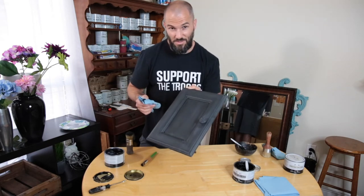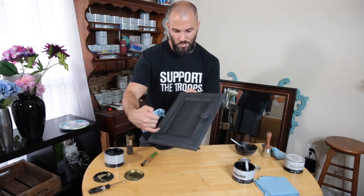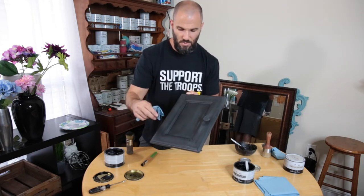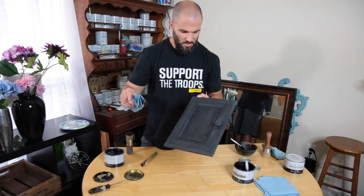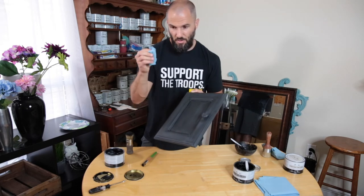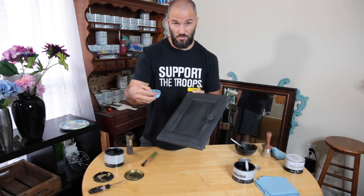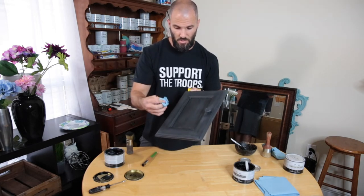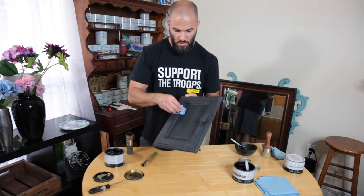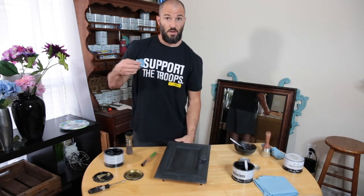There you go. I don't know how well you can see that, but now there's a more definitive black line going right down the crack right there. And even on the curved part, I was able to keep some in there just by taking that one little flat piece rather than taking the whole rag and doing that one number I was doing before. Again, being a little bit more deliberate about it, getting a really flat, straight line going over the ridges. It's only going to get the highest points when you're doing that, because that's what you want. You want to pull the wax off the highest points, and the deepest points you want to leave the wax on there. So just slide it across, just like that. So that's why I did a glaze and a wax.